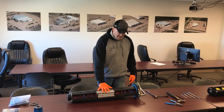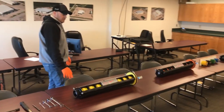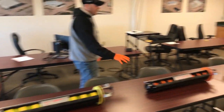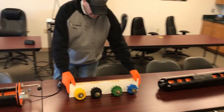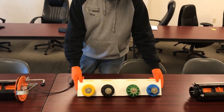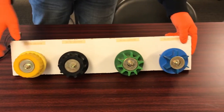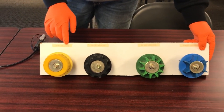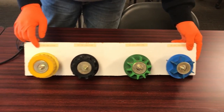We're going to tear apart a non-section control, but first we'll come through here and look at the different meter rollers. We have a yellow roller section control and then an orange roller section control, and then we've got a little demonstration to give you an idea of the color of rollers or the low rate to high rate meter rollers that we work with. The stickers are faded right here but in your book it will show you the rates that each color can work with.